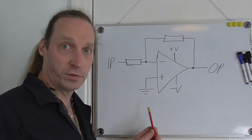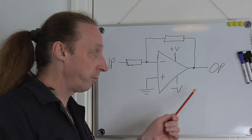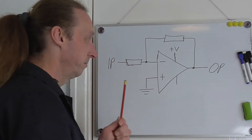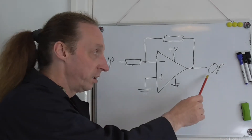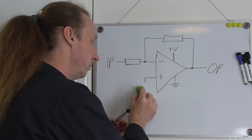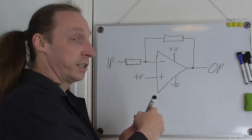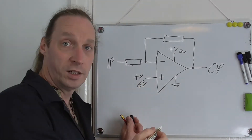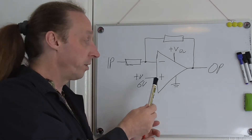If you've got a split rail with a minus voltage, you just put in your signal around ground as your input and you get an output whether it's positive or negative - brilliant. But if you've only got ground at that point, this needs to change because you can't go negative with ground there. So you have to bias the op-amp to a positive voltage. If this is 12 volts, I'd probably choose something like 6 volts as my bias. You've also got to bias your signal up so it comes in properly.